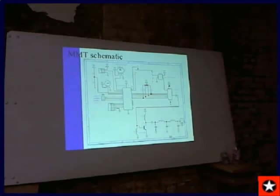You'll note the reference oscillator is a voltage controlled crystal oscillator, and the PSoC actually has a DAC output module inside the chip, and so I just vary the control voltage onto the reference clock synthesizer, and I can create teletype. I can do multi frequency shift key modes. For example, Domino on an HF frequency, that's an 18-tone mode, I actually can shift it 10 hertz at a time, directly, rather than modulating it. So it's really a neat way of doing that kind of frequency shift key mode directly on HF.